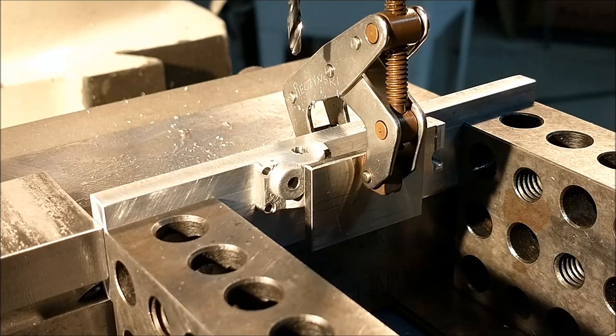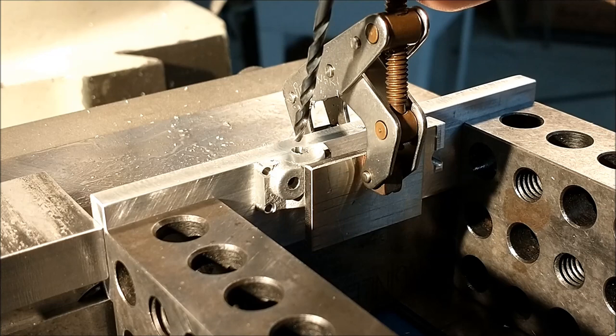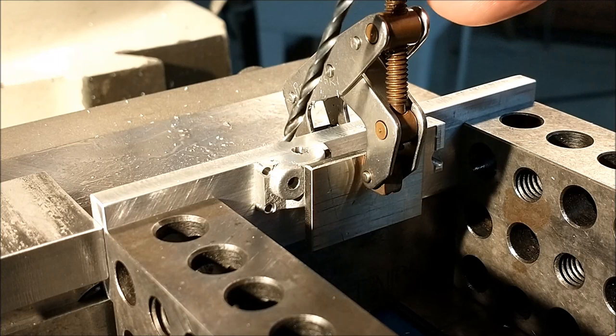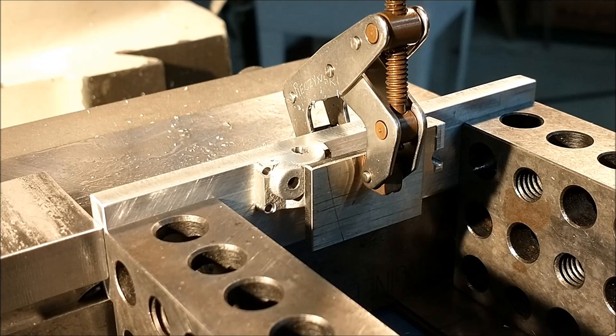We have a large counterbore inside this piece right here to allow the rack gear to clear the casting. That's why you see the feature on the outside. Since the drill gets through one side of this and now falls into that void, looking at this drill profile, I can see the drill walking forward because of the mismatch in the casting. This would happen even if it was assembled. Let's see if we can overcome that with a small end mill plunge, hopefully.